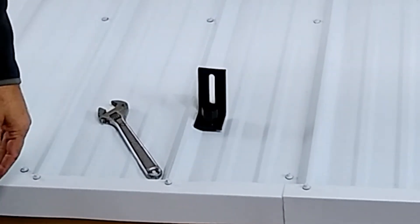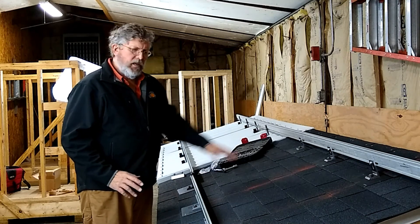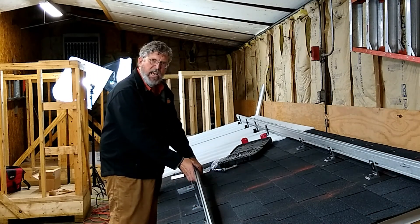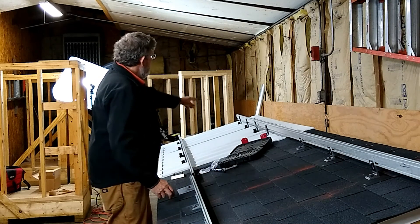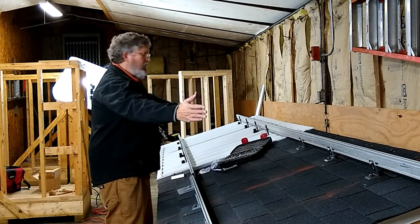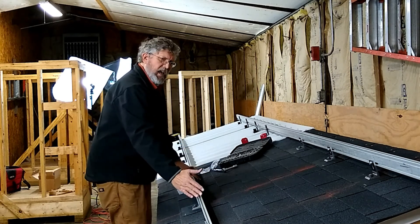All of our footers are in place — now it's time to put in the rails. I've put one rail up here and I want to show you how the other rail gets mounted onto the footers. Typically in the field you're going to find that you'll have to make a splice, so we'll show how those splices go together. I recommend that when you do a splice, stagger them so the splices are not lined up on the roof. For instance, here we've got an 11-foot section and then a five-and-a-half-foot section, with the full 11-foot section over here and a five-and-a-half there.